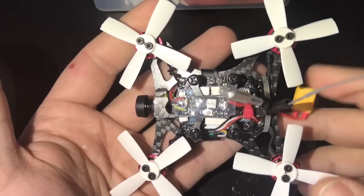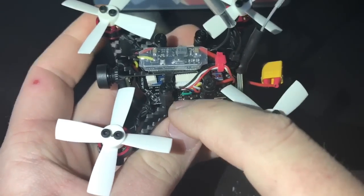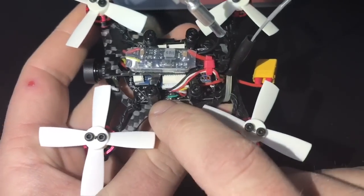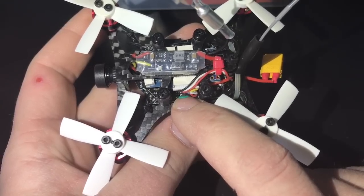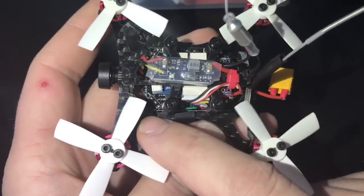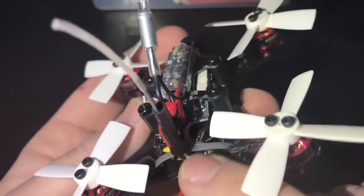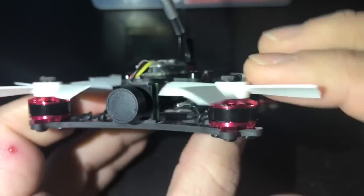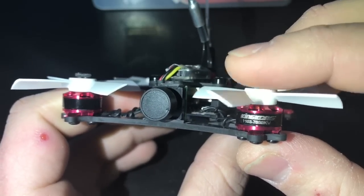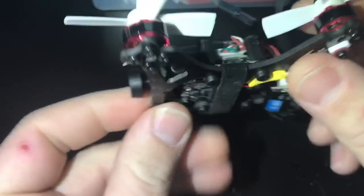This thing is tiny — it's a 90 millimeter carbon frame and the carbon is pretty thick and not very flexible. It has a 25 milliwatt FPV system, an F3 flight controller, and at the bottom an all-in-one ESC power distribution board — a 3-amp BLHeli all-in-one ESC. The motors run right into the corners, the power connector goes into the back, and the camera system wires down there too. It has super tiny 1103 7800 KV brushless motors and takes two-screw props.